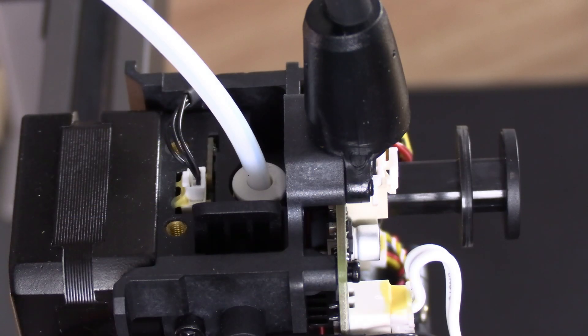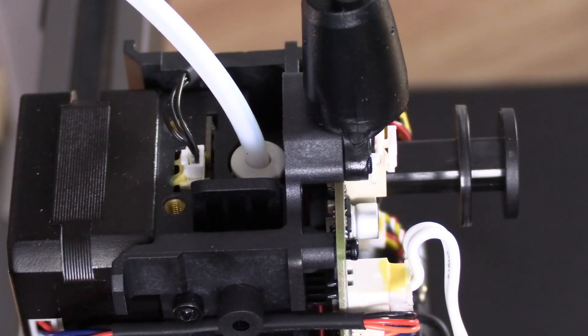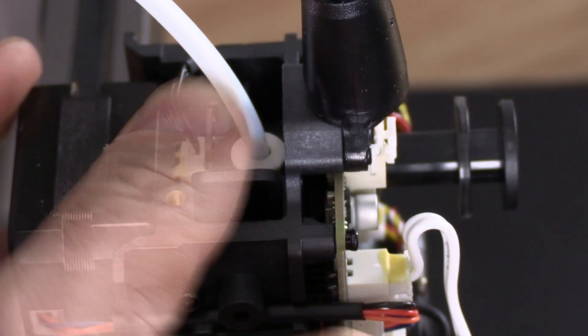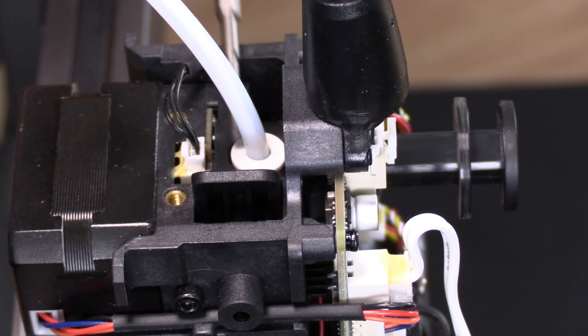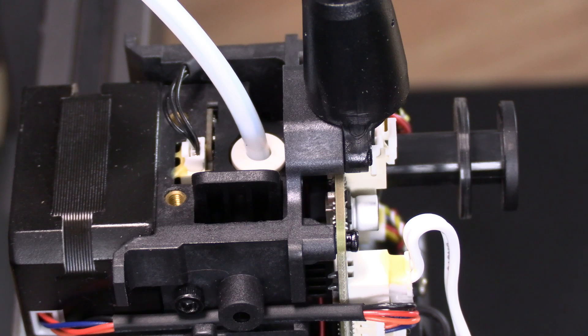Here we are looking at the top of the Hi-Combo toolhead. Here is the tension release lever — this lever opens up the gears removing the tension from the filament. It's a little on the stubby side, but this is traditional for Creality design. Here is the Bowden tube coupler. I do wish this release ring and the coupler in general was higher up, making it easier to access and depress. I would avoid working with this coupler and removing this Bowden unless absolutely necessary. Behind it is a very small piece of wiring and connector, which I believe may be the connector for the filament runout sensor.